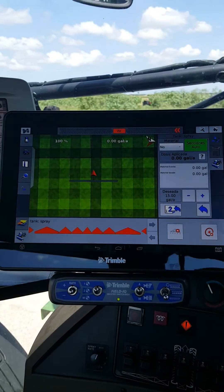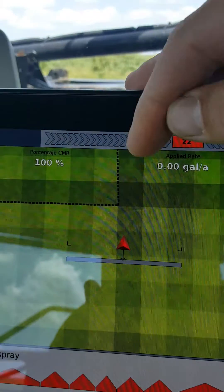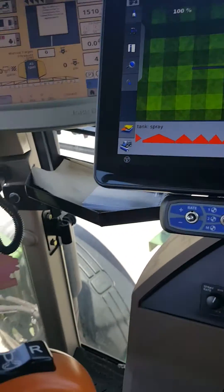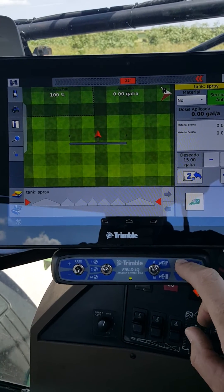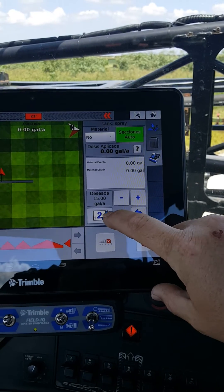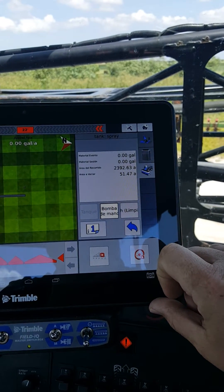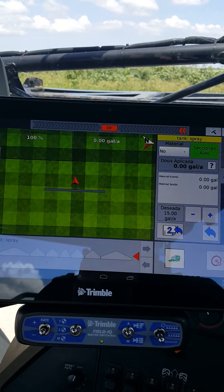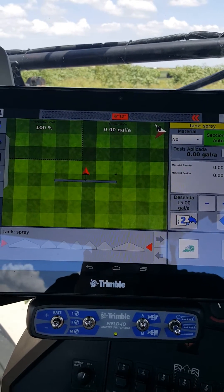This is asking if you want to use autopilot or not, and we do. If you look closely at this screen, you'll see these dotted black lines — that is a border. Anytime you see that border on the screen, it will not spray outside of this boundary. So we turn everything on, make sure our solution pump is on and the green light is on on our joystick. When we flip this on, you'll see our sections turn gray — they're not ready to spray.